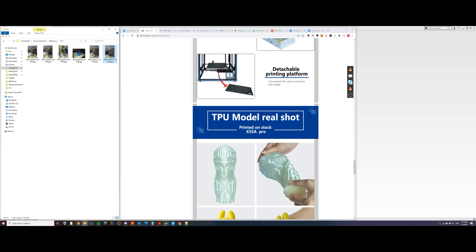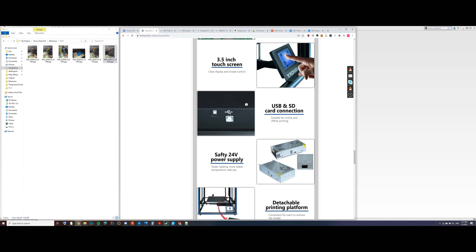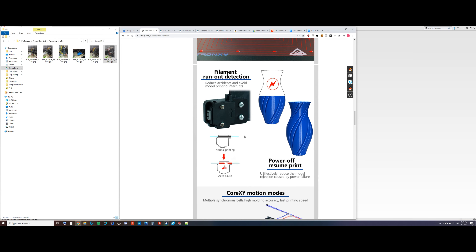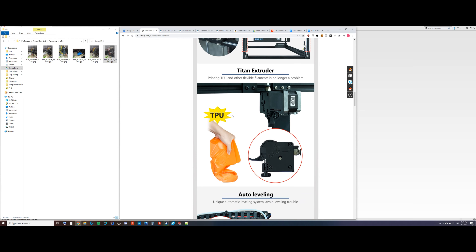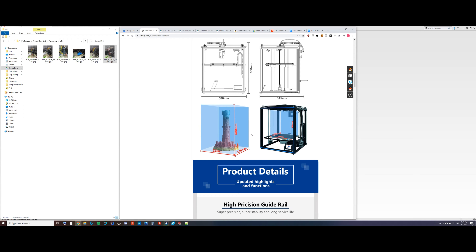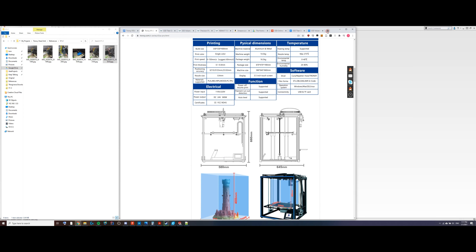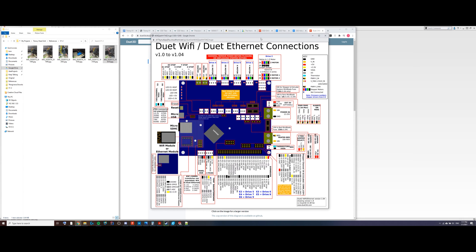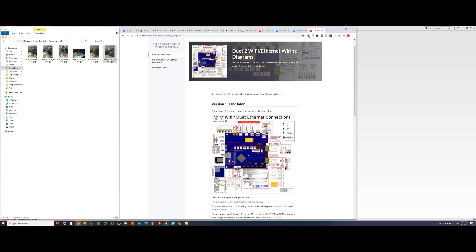Some other things I didn't like about Tronxy — they use some weird knockoff stepper motors in these and they're all wired backwards. When I went and upgraded the control board for the printer I used a Duet. This is a really interesting board, but the drive wires do not match up to the garbage stepper motors in the Tronxy kit.